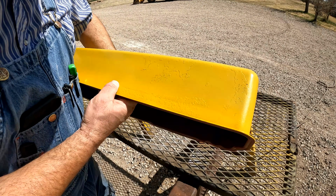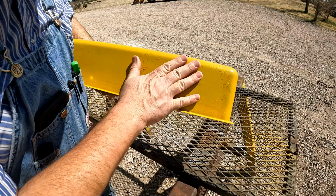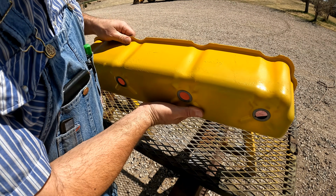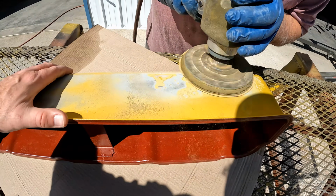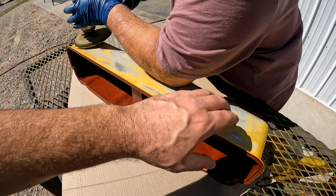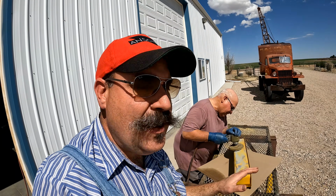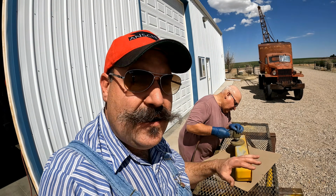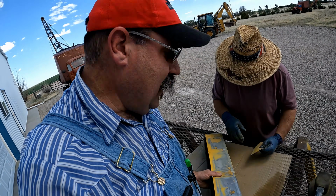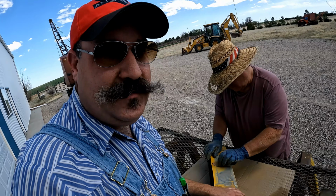It is. We were very unhappy with the finish on this valve cover, so we want to blend this out and have a nice hot rod looking finish on here. We could rattle can prime this. Yeah. We're starting with 120 grit, and we'll go lighter and feather it out from there. Dad's doing a little hand sanding, and we're going to bump it up to 220 grit.